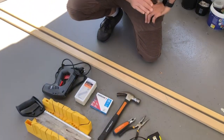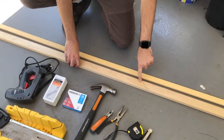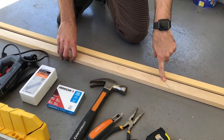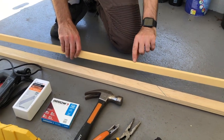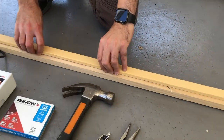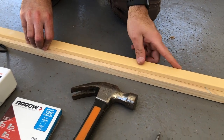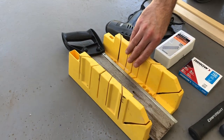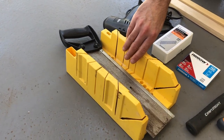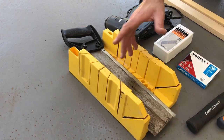These are the materials you are going to need for this project. So once you've measured out the size of frame that you want, you need to buy a piece of pine and measure out the 45 degree line cuts that you're going to make. You also need an equivalent length of pine molding. You can see there, just something with a round edge on the outside so that when we sit on the end of the pine, when we're assembling, then it's a round edge for that material to go over. You want to have a saw to cut those 45 degree angles in the frame. I've got a handheld saw here, but you might also use an electric one.